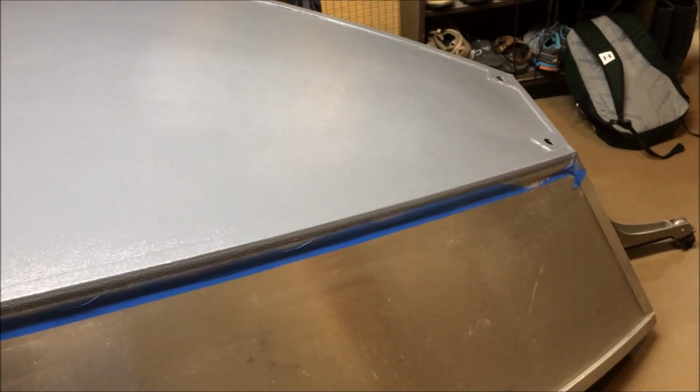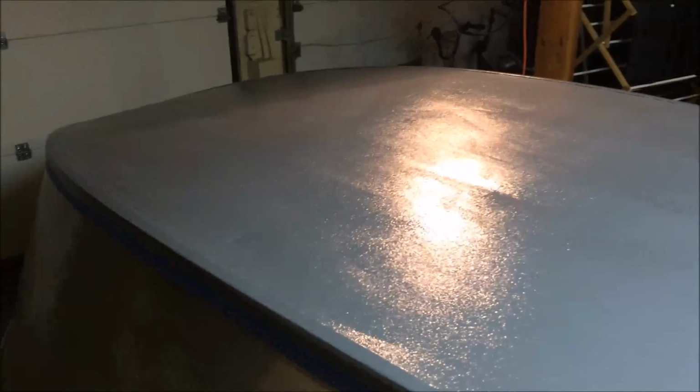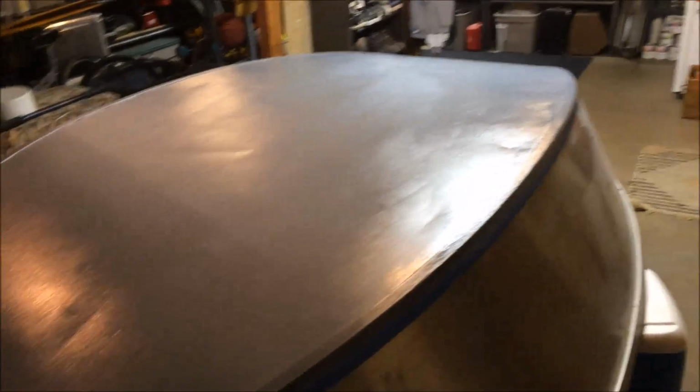Okay, I just applied the final top coat of Wetlander. I'm actually going to reserve some, so I used about 2/3 on my top coat. And here's the result. Leave a little bit more right here. A little bit more. That's what we got. I rolled it on. It's got a little bit of texture to it from the brush, but it's very slick. Got 2 heaters going underneath it right now to get it warm under there. I got my buddy heater, and then I got a little milk house heater going underneath it.